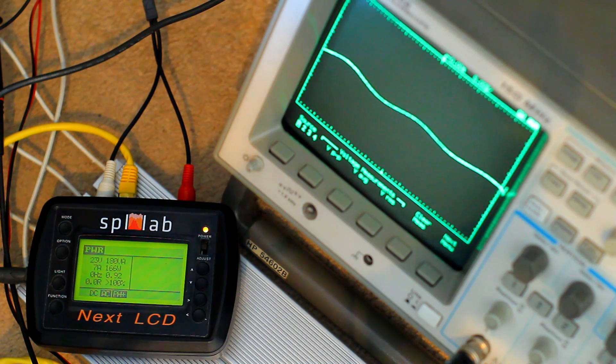That is about the most that it'll be happy at, and that is — oh my goodness — 166 watts! Didn't I tell you it was doing a bunch more power than rated? That was running at 4 ohms on a single channel. What's this rated for? 75 watts RMS. So when running this amplifier on a subwoofer with one coil per channel, each coil being 4 ohms, we would definitely see over 300 watts RMS to the subwoofer — compared to the 150 watts we all thought it was rated for, that's double the power. Fantastic.